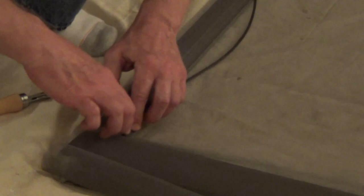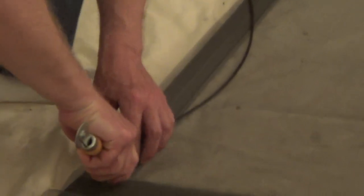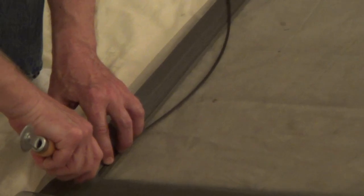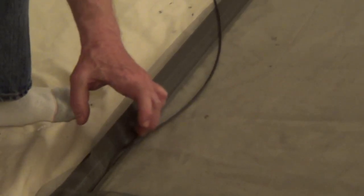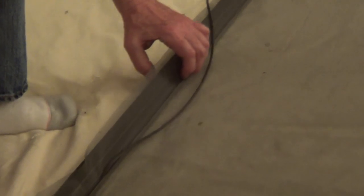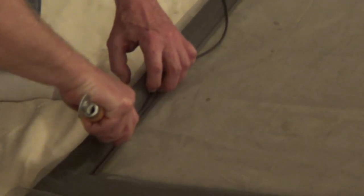So I have tape on 3 edges, and I'm just going to pull it just so it's snug. I'm not over tightening this, and we're just going to wedge this into the corner, and then using our tool we're going to set it in. And the trick is just using short motions, and I'm going to kind of use my finger ahead of this and keep it into the track, and I'm kind of just pulling it slightly tight as I'm working this tool, and just short movements.